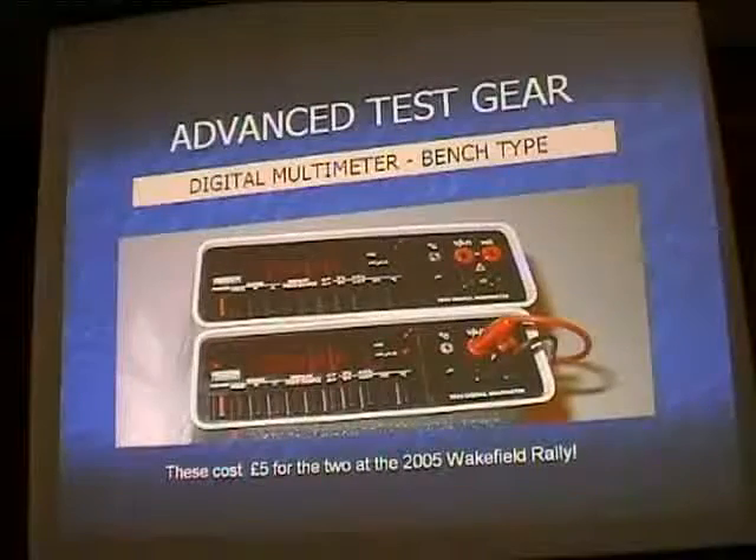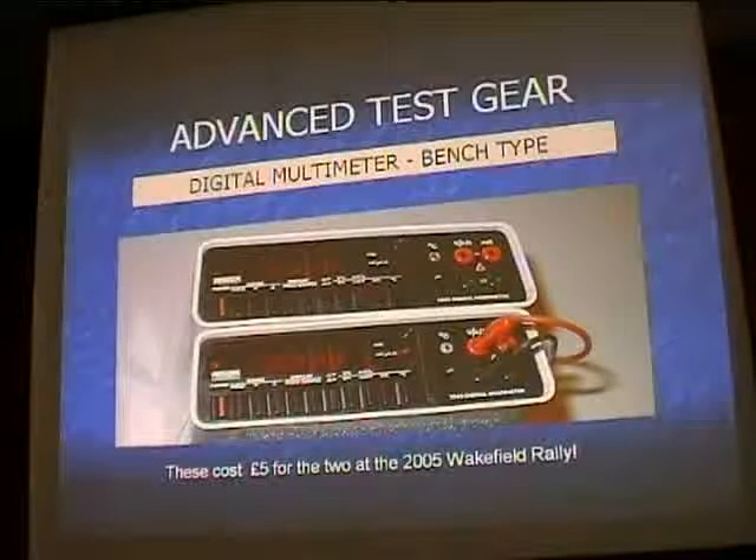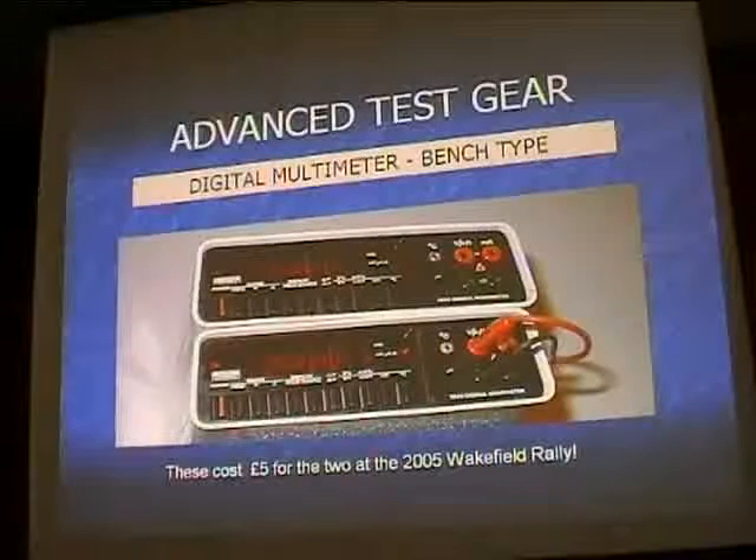So I made this little meter — it's got 3 milliamps full-scale deflection, which is really handy for a lot of the measurements we take. You can see it on a nice big meter. Nothing special about it — you could soon knock one up yourself. You just have to get the resistors right to make it read the proper scale. That's one of the most useful pieces of gear I still use a lot. You can buy a more advanced digital multimeter, but it still won't be useful for these very minute adjustments for maximum RF output. You need an analog meter.